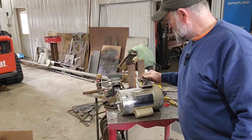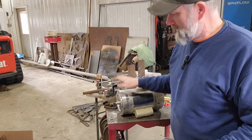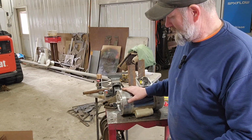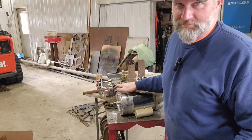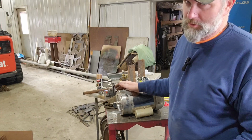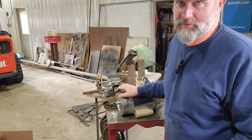Okay, just a little tidbit. I don't want to set up any electricians for an argument. I normally don't do this. If this wasn't such a new motor and a good quality stainless steel bodied motor, I probably wouldn't have done it. Usually, even a year or two old in the environment that this is in, a motor is all rusted up and isn't going to come apart. It's hardly worth the hassle. So if an electrician or a repair guy or your service guy tells you he's got to put a new motor on, don't argue with him, because he's saving you some money.